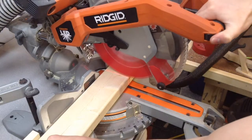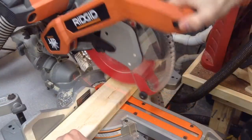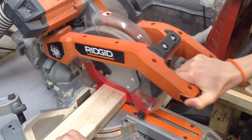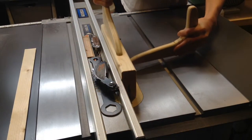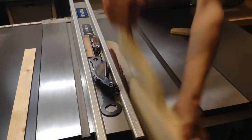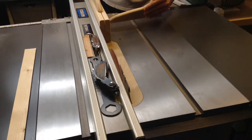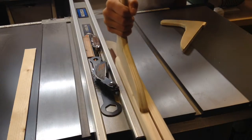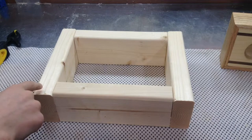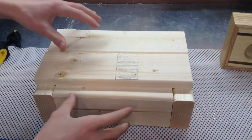Most of the ski rack is going to be made up of 9-inch long sections, so I'm cutting some of those out now. I also need another piece at a foot long. Here I'm re-sawing a 2x4 down for a bottom. The bottom is made up of 9-inch pieces in a square shape, and the re-sawed 2x4 serves as the base that we mount to the wall.